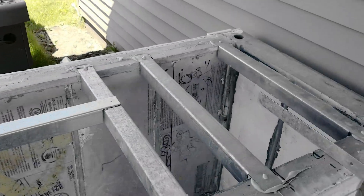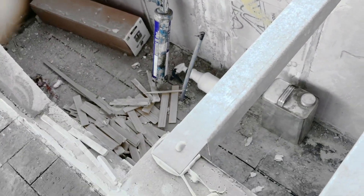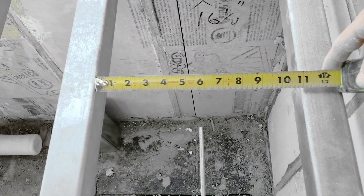The galvanized cross braces have been installed. They are screwed into the top of the panels or glued with construction cement as shown here. They should be spaced 18 to 24 inches and flank the grill and any other top-mounted appliances.